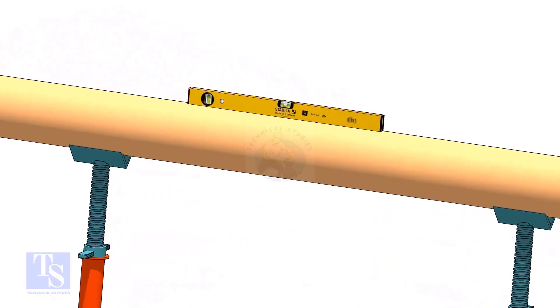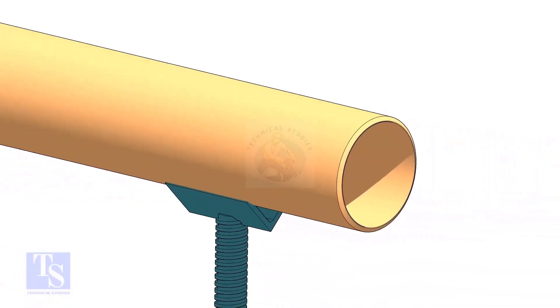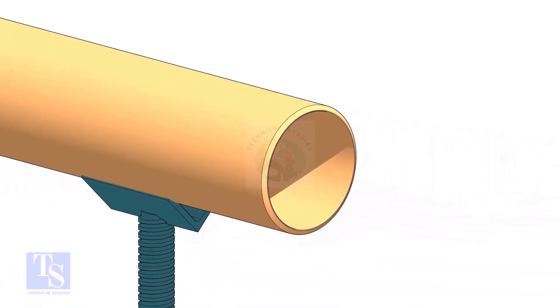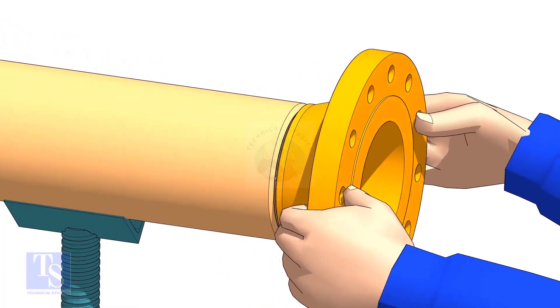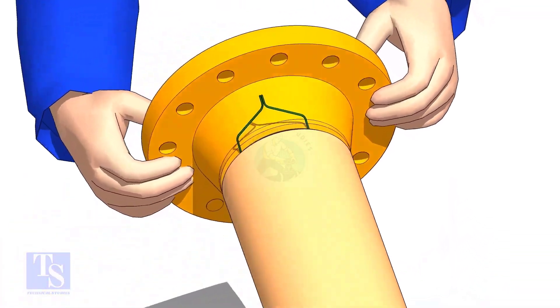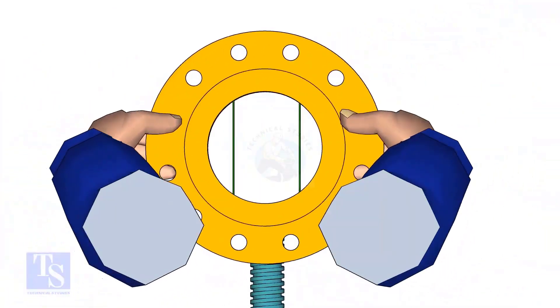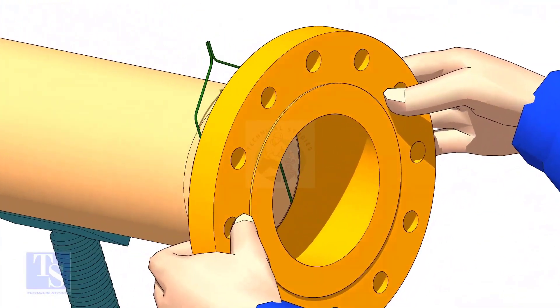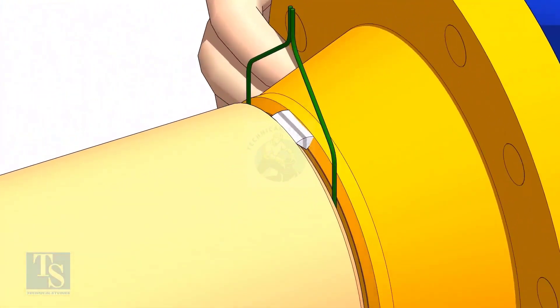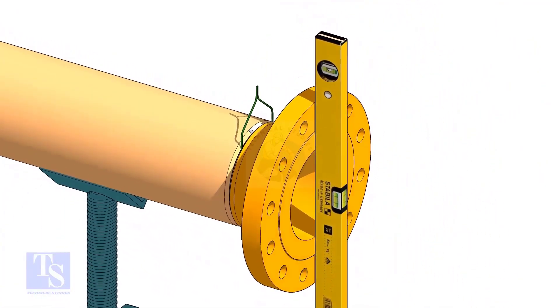Level the pipe. Hold the flange on the pipe face as shown. Put the gap rod in the joint. Look through the flange and the pipe, and adjust the overlap. Tack weld on the top side of the joint. Check the level of the flange vertically and tack weld on the bottom side of the joint.